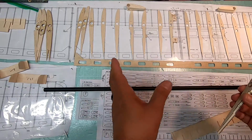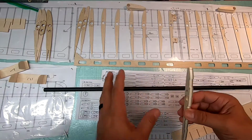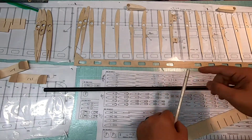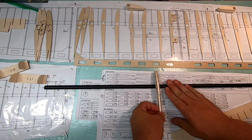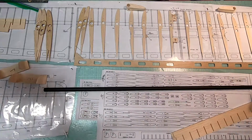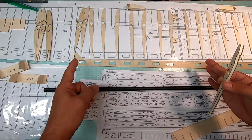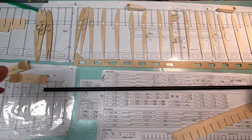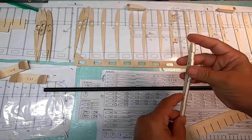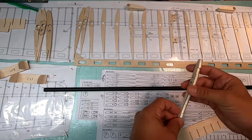So I'm definitely going to proceed with the way I'm doing, with drilling the initial pilot holes from below through the blind nuts in the fuselage with the fuselage lined up to the wing, versus just trusting that even though I have this at a 90-degree angle, even a half a degree of variance here, or from the hole not being perfectly centered or something, is going to manifest in a big difference with a 2-meter wing as far as rotation goes. If you're talking a wing that's this big, a half a degree isn't very much. When you're talking 2 meters of wingspan, that angle diverges the further out you go and becomes a much bigger issue. So you really want this to be precise. So you may want to follow the way I'm doing the holes. In any event, I'll demonstrate this as I go.